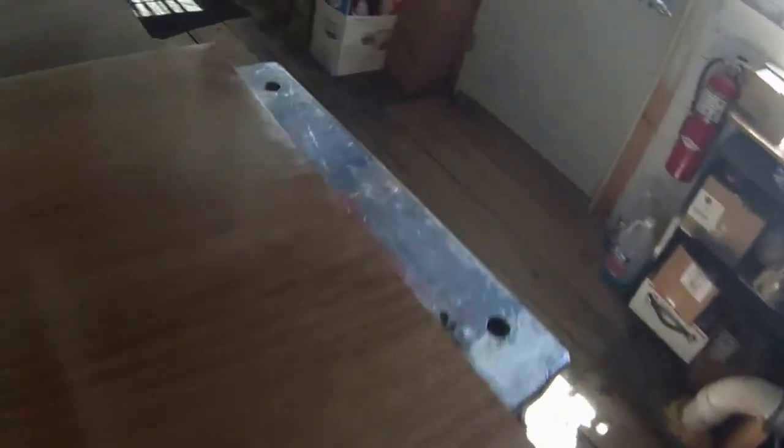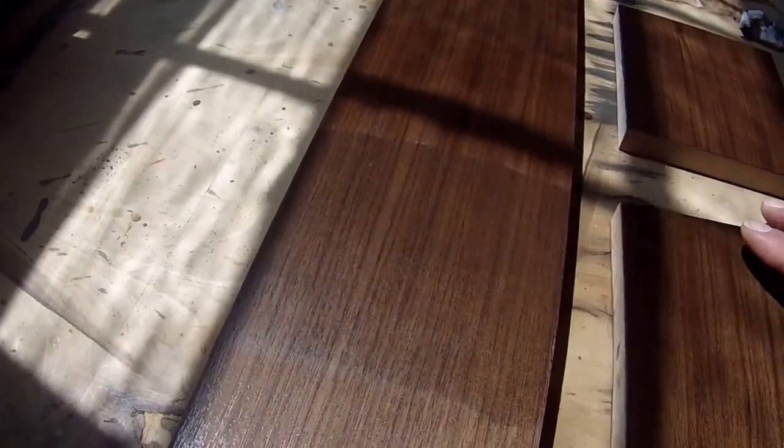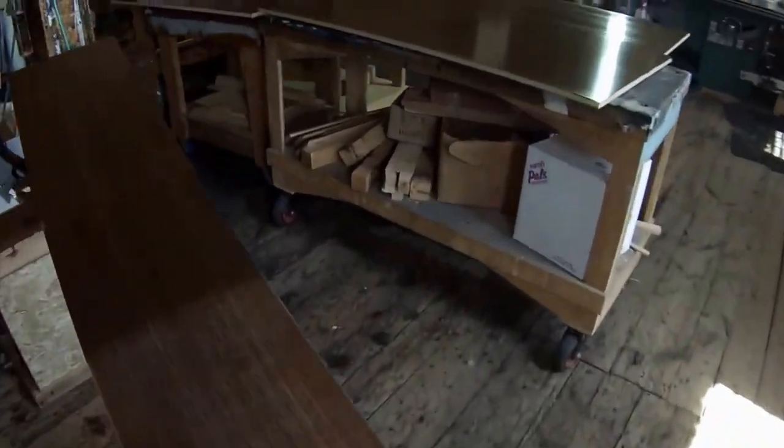So what I'm going to do is I'm going to sand these two light panels, and I'm going to try to tone it to get the color to even out. I did some tests yesterday with some products that I had. I did a test piece with the sample. So this is just the finish after I sanded it. Then I applied some different products here, trying to get this to darken up. I actually had some success with this one here. This was the darkest stain I have. So I can get this to darken up a bit. So this lighter wood will then match this darker color.